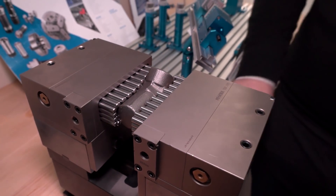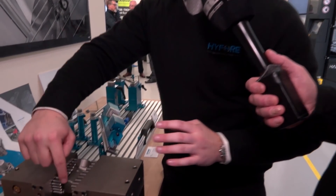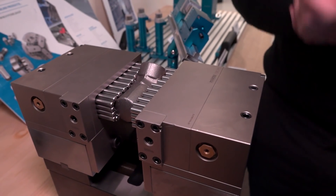Is there a clamping force that people can use? Yes, you can get 0.85 of a metric ton in clamping force. With vices, people talk about pull-down, pull-up, neutral — do any of those apply here? It's a bit different because the component is wrapped around, so it gives you a precise accurate fit. Each individual pin locates at a certain point on the component, so as you're wrapping around it you get a true holding force on it.